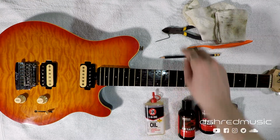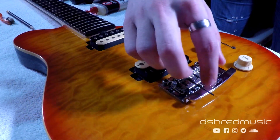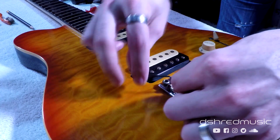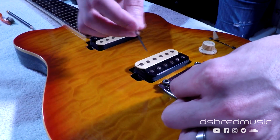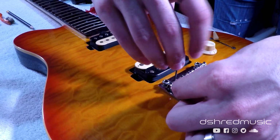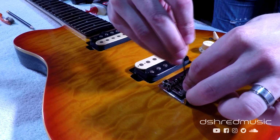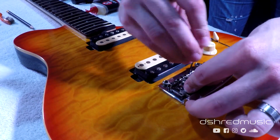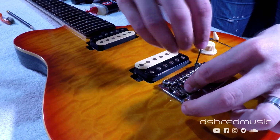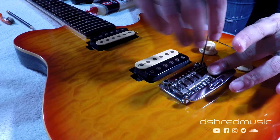Once you drop the 3-in-1, you want to use the hex key to manipulate the screws back and forth so that the oil can spread evenly within the threads and loosen whatever rust they've taken. If it gets messy, don't forget to clean any excess right afterwards.